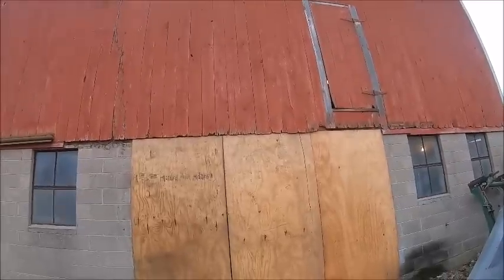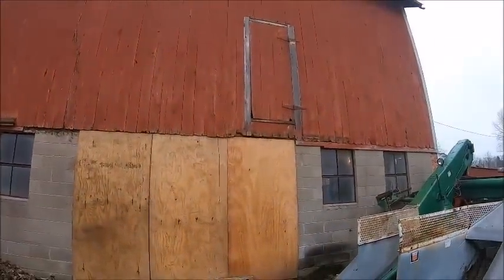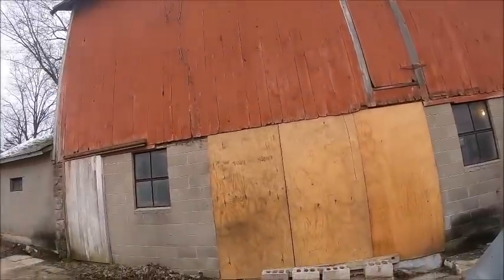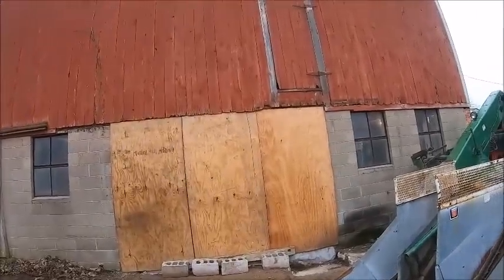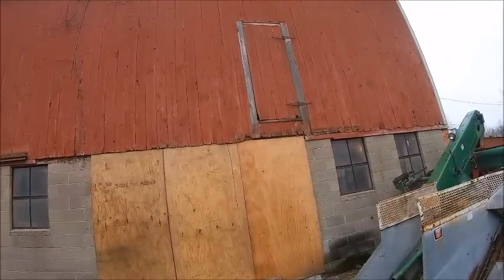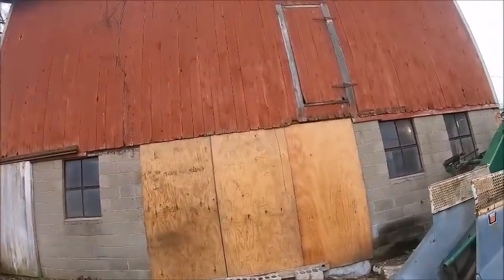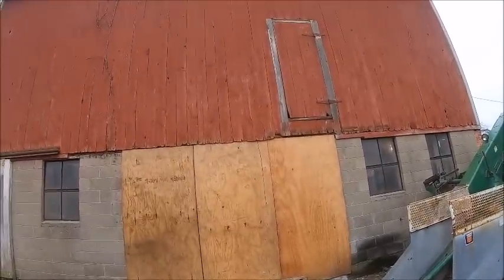And then I think we're going to put linseed oil on it to help protect the beam from any further rot. I'm hoping I can put it in a pump sprayer and spray it on. Hopefully it's not too thick for that. We'll find out. I'd say I could cut it with diesel fuel, but I don't really want to go soaking a beam in diesel fuel, because it's kind of flammable. Well, linseed oil is flammable, but it's not nearly as flammable as diesel fuel. But anyhow,